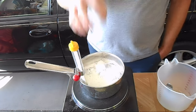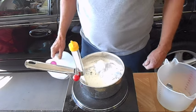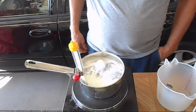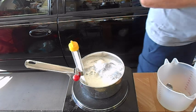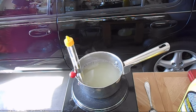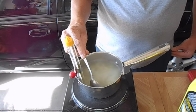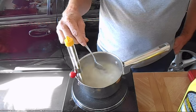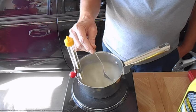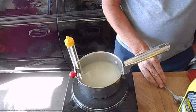You're going to have to keep an eye on this because it's going to try to foam up — you have to cut back your heat. The water I use is always distilled water. If your temperature starts coming up too high you can knock it back with a little distilled water, then basically leave this to cook for a while. After cooking, the steel wool is all dissolved. I've been trying to dissolve as much of the manganese dioxide as I can — it never gets 100 percent — stirring and keeping the temperature between 190 and 200. Now I'm going to cut the heat off.